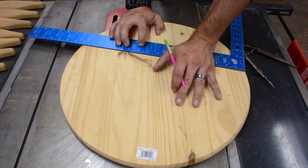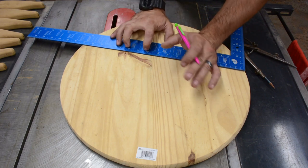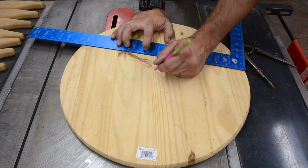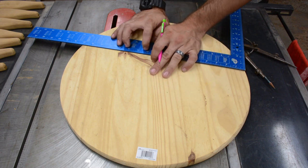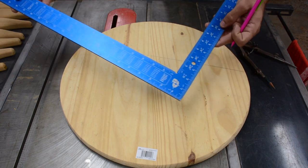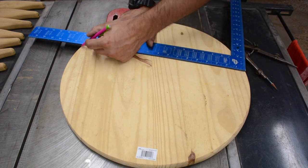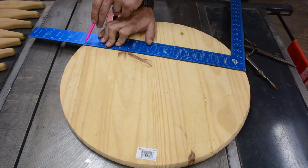This is a 17 and three quarter inch prefabricated round I purchased from Home Depot. I don't remember exactly how much I paid for it off the top of my head — I'll look on their website and put a link in the description. The most important part of this process is finding the dead center of it, just to make sure everything is perfectly balanced. If you're not familiar with how to find the dead center of a circle, it's a pretty easy process. All you need to do is take a straight edge — I like to use these longer squares — and draw a line from one side to the other, making sure the line touches two points on the perimeter of the circle.